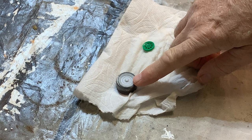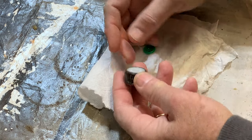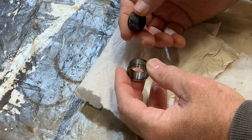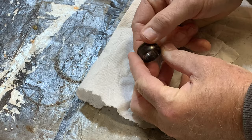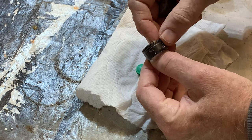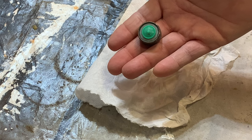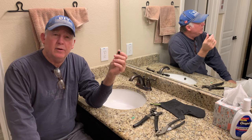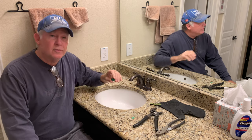Here's the faucet that had probably the worst calcium deposit. I soaked it in CLR for two days and took off the cap. That looks good, and I was even able to take out the aerator and clean off all the deposits. You can see the only thing left is the scuff marks from when I tried to take it off with a wrench before I used the CLR. Now we're going to screw it back on and have free-flowing water. Cleaning the aerator of your faucet with CLR is a wonderful, quick, easy method to make your faucet flow better.